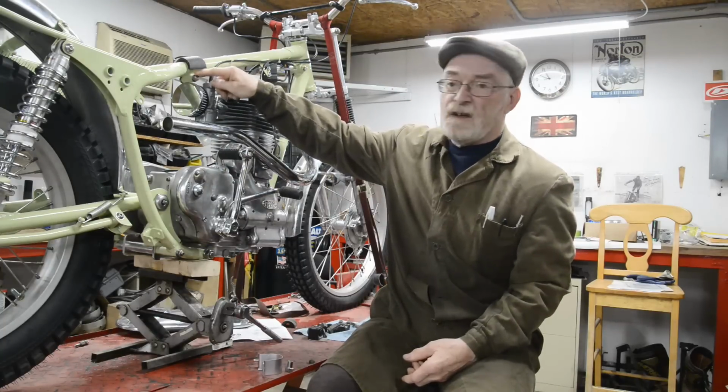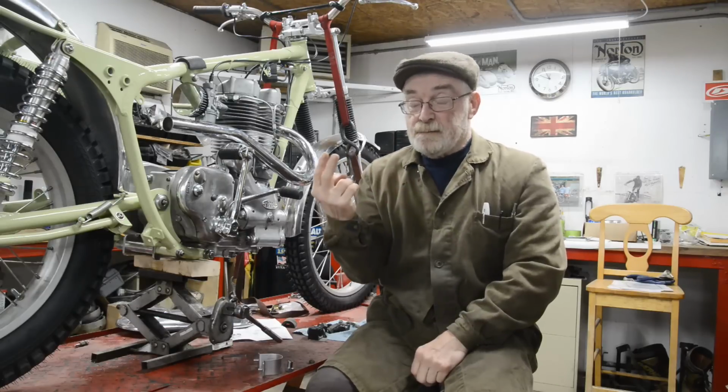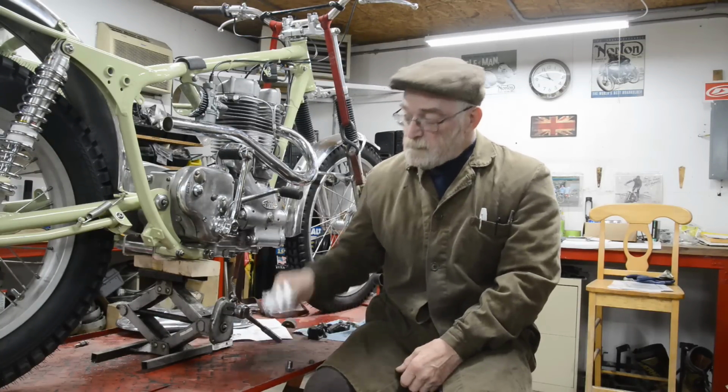I'm painting the petrol tank. I had thought that I had to weld a couple of lugs on the petrol tank to mount it up here. I think you can see that. But of course it suddenly struck me that I was wondering why someone had cut them off, and then I thought, well, nobody did cut them off. This isn't a bullet tank. The one for the TT7, which is where it was from, the Interceptor, has a mounting underneath. It bolts into the bottom of the tunnel, and then there's a cross piece. So of course I didn't have that piece, because the one I did have for that tank I used on the new tank when I built the Interceptor. So I thought, bugger, I'll have to go to Hitchcock's again for one thing, and then I thought, no I won't. So I made one.